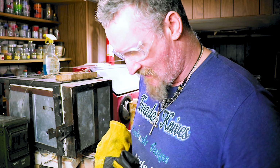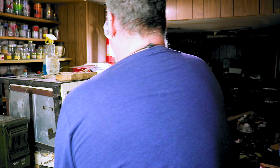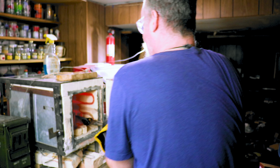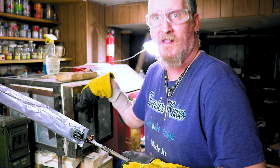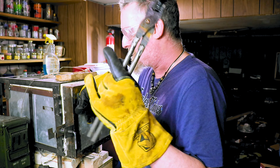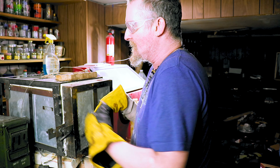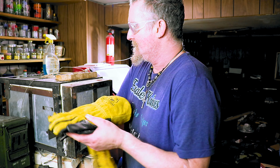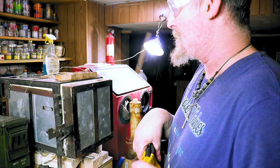I went upstairs for like 25 minutes. I'm glad I came down. It's already been kicking for 15 minutes at 1500. I got it coming down to 1300 already. Oh, it's good. I was wondering how it would be to hold one of these, but both are in together. I was a little worried these homemade tongs wouldn't hold, but if it holds two blades at once, we're good. All right. We're already down to 1290, so whew, that came down fast. So I'll let this sit for 5 minutes and then put her back in.